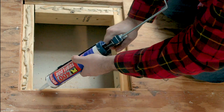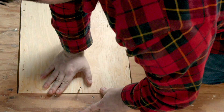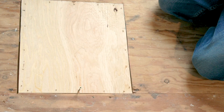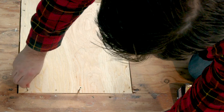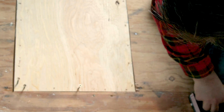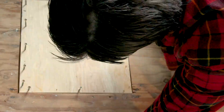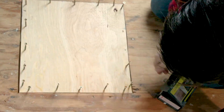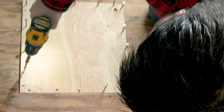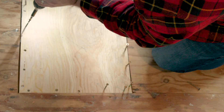I'm going to place the board back in. Off camera I did drill some pilot holes in the wood — this makes it much easier to set up the screws without having to hold the screw in my hand when it comes time to tighten everything down. I'm putting these screws about every five to six inches. I am trying to screw these in at a slight angle to make sure that they make contact with the new 2x4 framing underneath.